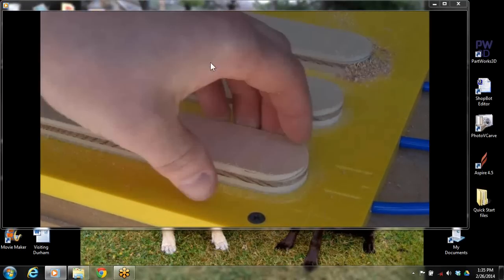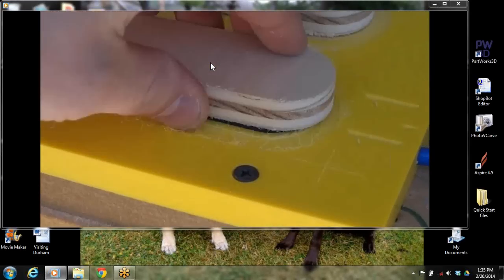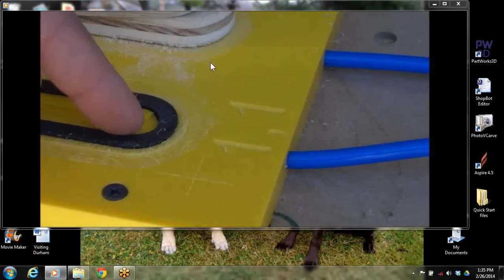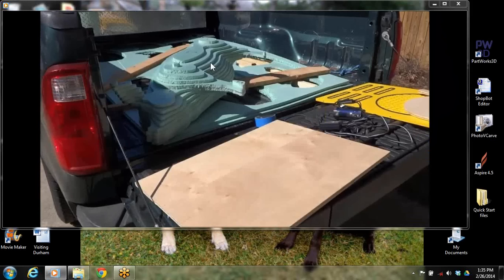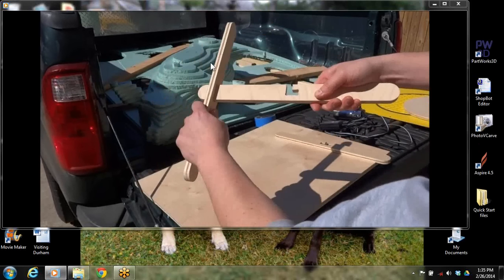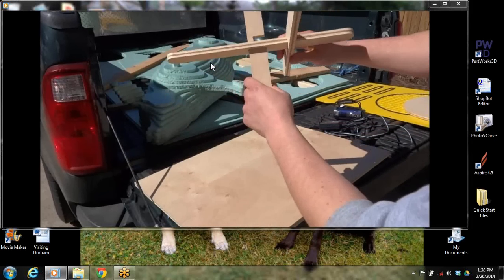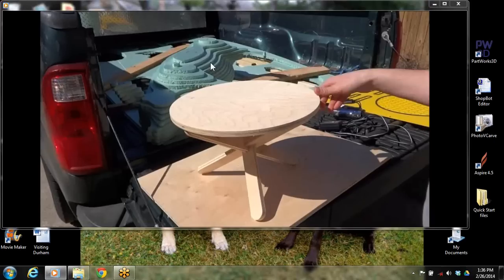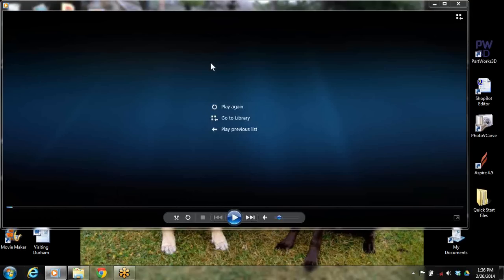You've cut into your HDPE just a little bit — maybe not even ten thousandths. Just inside the toolpath is your gasket, and the grid is inside that. So that's what we were doing — we held these puzzle table pieces down with the vacuum jig. We created a vacuum fixture, and now I can make these really quick. You can cut these at shows, throw them on, and you've got a vacuum fixture that will duplicate the cut again and again.